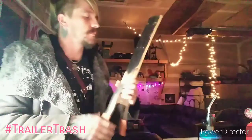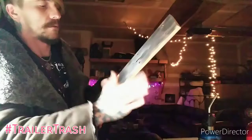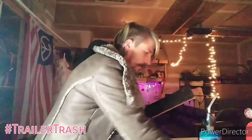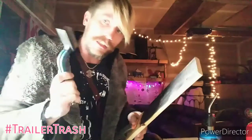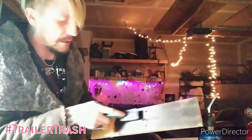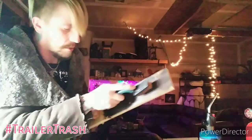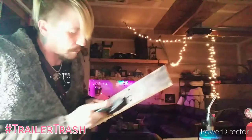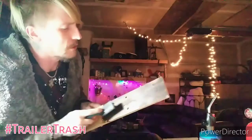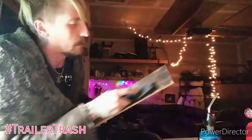As you can see here, it's pretty dark. Let me take a moment to cool off. What we're going to do is take our steel brush and scrape with the grain of the wood. This should bring off any of that soft wood that we burned at first, and it should leave the hard wood that got scorched the second time around with that longer pass.